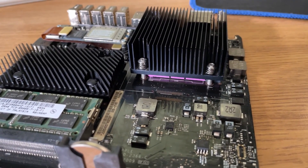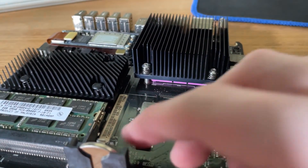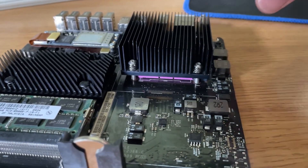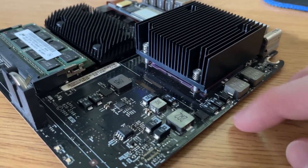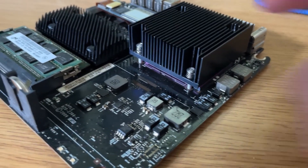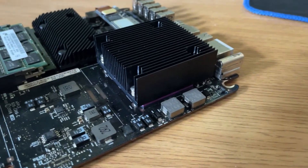The original spring pins for the heatsink were not long enough, so what I went ahead and did is use screws with springs and nuts on the bottom — that allows the heatsink to be in the correct position. Since I'm now using metal screws and springs that touch the board with the nut on the back, the heatsink is still grounded. It doesn't really matter much, but for EMI it is still grounded.